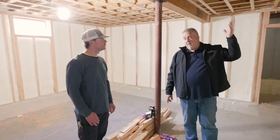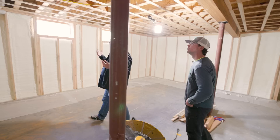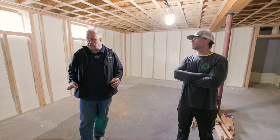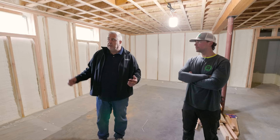We have the laundry room. Some of this is pretty typical of all houses — everybody has a powder room. But really, it's about the strategy we used here. We have the luxury of having these utility spaces that connect. Our sewer line exits here — we were fortunate enough to get that out underneath the footing, which is perfect. Pretty much everything that's laid out and structured here is running due to gravity. We don't have any pumps, no ejection pumps. Everything flows by nature.